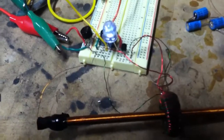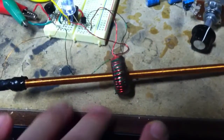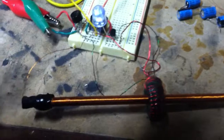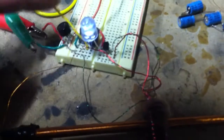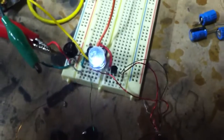But right now, I basically just have it going into a full wave bridge rectifier into a Joule Thief, but then I made it a 3-phase. I added basically a solenoid coil through the center, and plugged one. It's a double positive, so one's feeding right back into the bridge rectifier positive in. And then the other one is back in this voltage doubler I have with these germanium diodes, a simple voltage doubler. It's feeding the positive end of the voltage doubler. And then I have a 2N3904 transistor, really low value, to kind of get this thing firing.